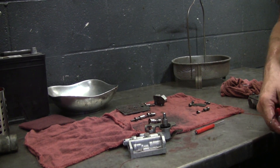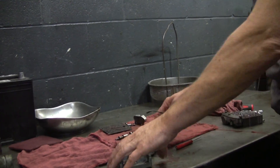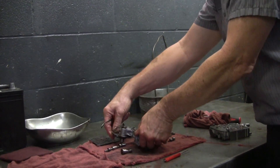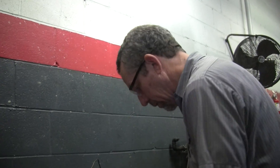When it's running you never get a leak out of here because the fluid is way down below — about that much from the bottom of the pan on the dipstick. This is very common on automatic transmissions: they won't leak when you drive them every day, but if you let it sit for a week or two you suddenly get a big puddle of red fluid, because the torque converter has drained back and raised the fluid level.